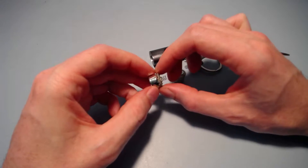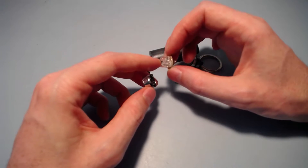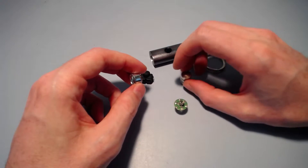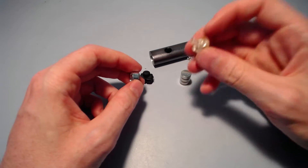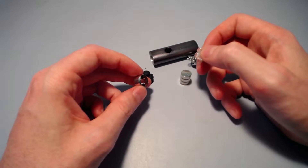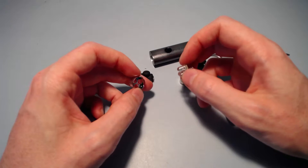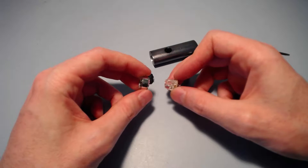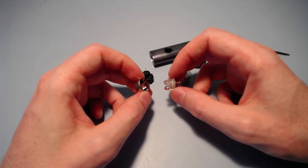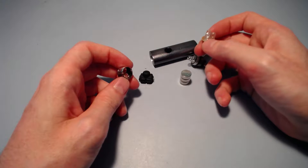The LEDs are just three white LEDs on a little circuit board, all in parallel — which is a bit silly. These cells are rated for about 1.5 volts each, totalling 4.5 volts, and white LEDs have a forward voltage of about 3 to 3.3 volts. You're over-volting them by about a volt and a half. I'm not surprised they failed — they've probably been burnt out or over-volted. I don't know what the designers were thinking; it just seems like a bad design.